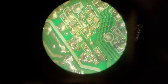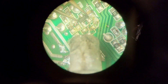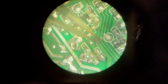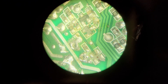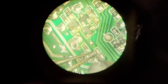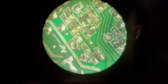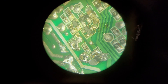Probably that could be a reason - I'm not sure, just saying. As I said, I'm replacing the gate driving bipolar transistors. NPN and PNP types - their bases are always connected together, and from the IC comes one signal, and those transistors drive the gates. They were fast and used everywhere. That 10 ohm gate resistor was blown, so now I'm putting a new one.